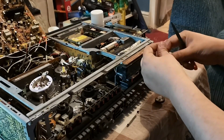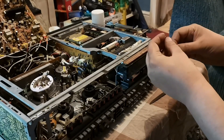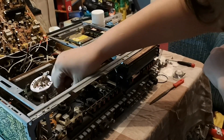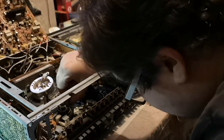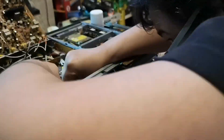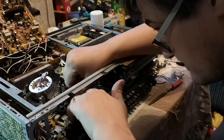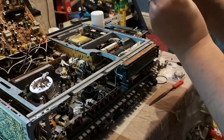The video heads I left alone, as I discussed in my 3v35 video — I'm only cleaning those if I absolutely have to. The audio control heads and erase heads got the standard amount of cleaning, and the tape path and the actual loading mechanism were lubricated as well.